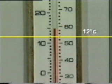We then move on to site conditions. In the hanging instructions, we advise that the site is heated to a minimum of 12 degrees centigrade. Below this, the adhesive may not dry fully. It's important that sites are well lit, with lighting similar to that in which the wall coverings will be viewed when the premises are occupied. Lighting conditions can greatly influence the preparation and how well the product is installed.